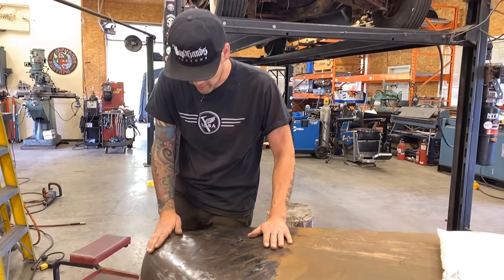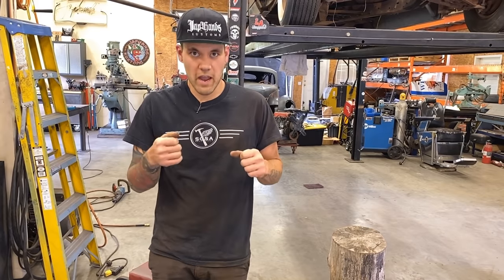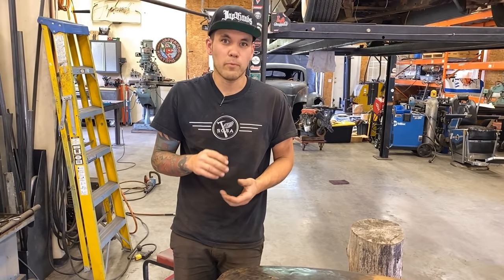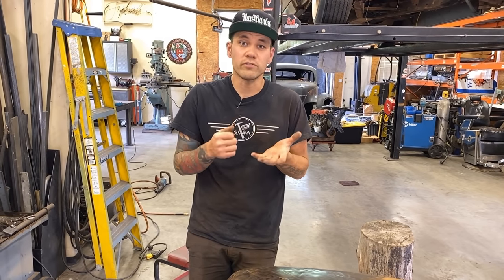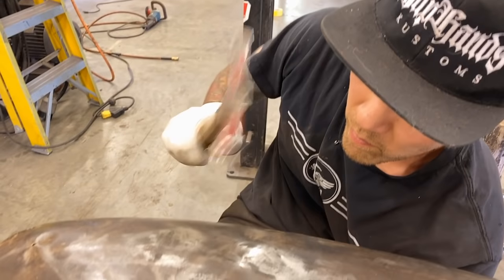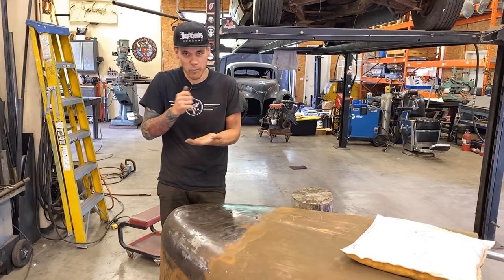It's pretty good — a lot of this stuff is out of here now. Now comes the time when you want to be really careful of your dolly choice and your hammer choice. In the first video you might have heard me say finding the perfect dolly and hammering right on it when you're stretching the metal — that wasn't the time for it, but now it is. We're not trying to stretch the metal per se, but we're trying to planish it. So it's important to find the right curved dolly, hold it underneath, and basically hit it a bunch of times with the hammer to smooth it out even further, overlapping the contact patch of your hammer.